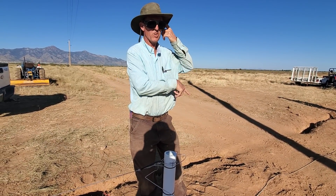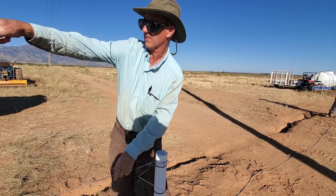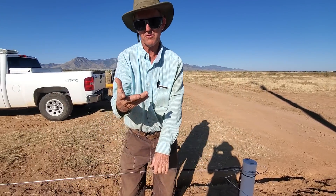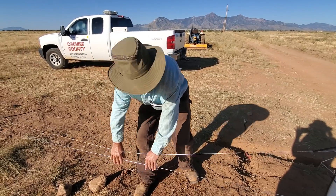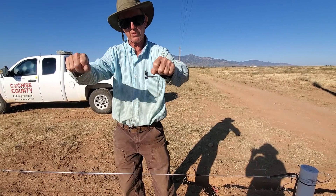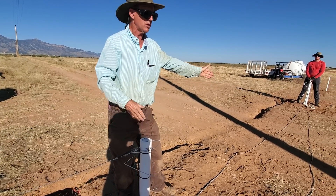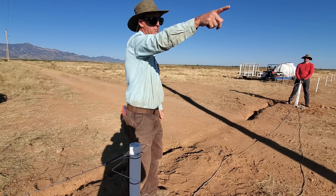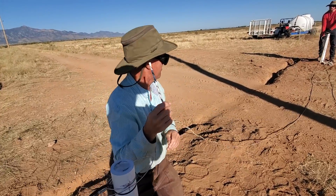Now we're to that gate. We've only got two gates on this whole operation. On these long runs — this particular one is 2,000 feet — we're going to put a high-tension spring so the grazer, with a bar on the front of his four-wheeler, can hit this fence anywhere and actually drive over it. If you put a spring in the middle and hit it with your four-wheeler, the wires will give enough that you can have a gate anywhere you want. But this is a road gate, so it's only closed when animals are in this section.